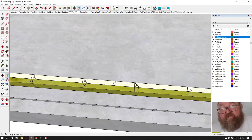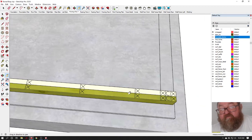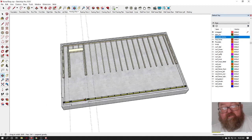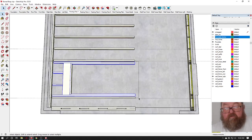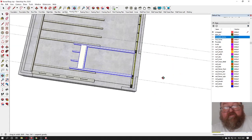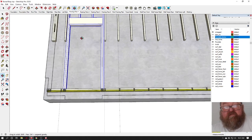and on these other walls we'll have windows, and they're basically the same as the doors, the way you lay them out, okay? And at the end there's your corners. The two longest walls, the reason I started with this wall is because it's the longest wall, and then this is your other long wall, so you would do your two long walls first. So now what you do is you would put in doors and windows first. I'm going to grab all that, I'm going to put that in first, 5 feet, okay? If you put your doors and windows in first, you'll know not to lay studs in there, because the header will be there.